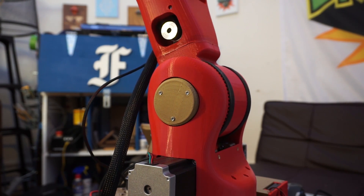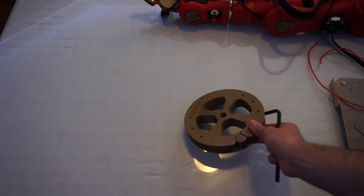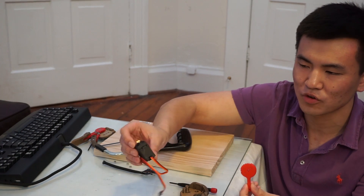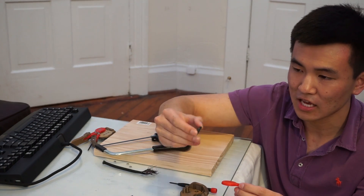Because we had to remove the shoulder, we decided to replace the glow-in-the-dark gear with the newly minted golden gear. We ran into kind of a dumb problem here. To get the gripper working, we need to connect the gripper drive gear to the servo motor. But as you can see, they don't just fit onto each other. So to do this, we're going to use a mounting plate.